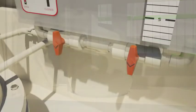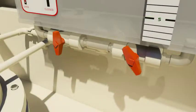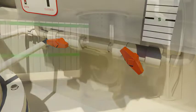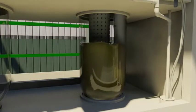Then the hydrochloric acid valve is opened slowly and desired quantities of HCl are fed in the digesting vessel. After finishing HCl feeding, the nitric acid transfer valve is opened so that it is fed in the digesting vessel. The quantities of these acids are predetermined and calculated as per the alloy composition of gold, silver, base metal, and other impurities. Upon completion of acid feeding, the Aqua Regia, which is mixed acid, starts reacting straight away with the alloy, percolating through the perforations.